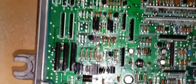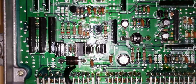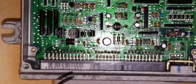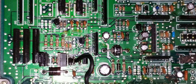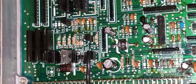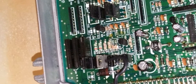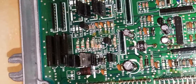We got all the components installed on the board that we want to solder in. We have the four components installed on the top left corner of the board for the PWM boost kit. We have the D14 diode installed right here — please note the orientation: the line will match the line on the board, and there's an arrow going towards the plugs, so the gray line is the line that's on the board. The transistor is right here. R70 and R71 right next to it. We're going to flip it around and get them all soldered in.